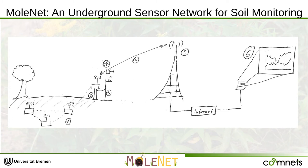Let's have a look at our system architecture. Number one is our sensor network itself — these are the buried Molenet nodes, meaning the buried sensors and nodes can communicate between each other and also with the base station. The base station, marked with number two, can have a weather station attached to it adding additional data. The base station communicates with some kind of infrastructure such as the LoRa network, cellular network, or Wi-Fi connection. Via the internet, the data is transmitted to our data server where the user can access the data and see the most recent graphs from the measurements.